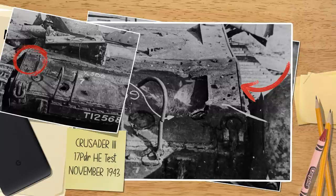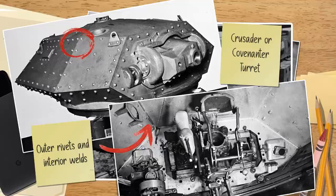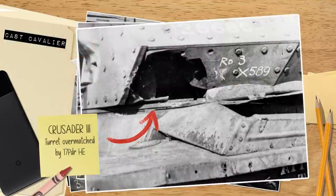Particularly when struck by high explosive rounds, this left the plate loose, meaning the tank's armor was more or less literally hanging on by a thread. As we covered some time ago, the British, like many nations at the outset of the war, relied heavily on a laminate type of armor for protection. This involved using a carbon hardened steel — often baked over bone charcoal such as Vickers plate — to break up monoblock armor-piercing rounds as an outside layer, mounted to a softer machinable quality inner steel plate.